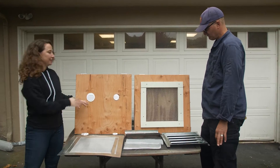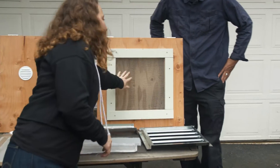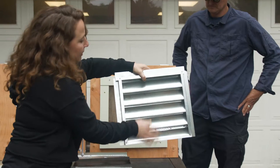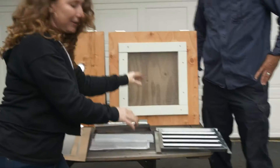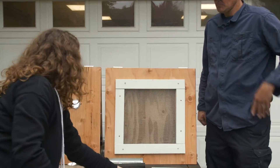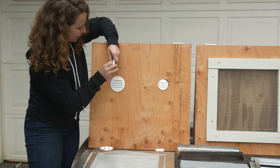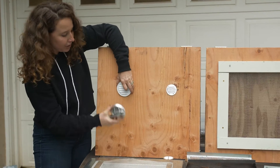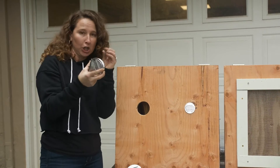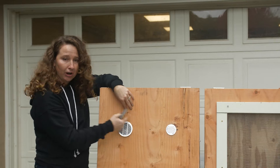I just put together a couple of examples of standard vents you'll find in attics. So this is a dormer vent — right now we have an 1/8-inch mesh on here. On this one you'll see we've got the louvered outside and a pretty wide gauge on the inside. You really want to get down to a 1/16-inch mesh behind any vent to prevent embers from getting into your attic. And these little guys are great — they have a 1/16-inch mesh on the backside, louvered on the front, so that'll take an ember shower down and away. You could also do a honeycomb vent, which will actually close up and keep embers all the way out. Direct flame and those will melt right up. They just pop out, put a little caulk behind it, and pop them right in. Very simple install if you're handy on a ladder.